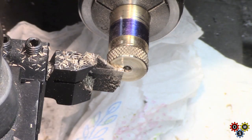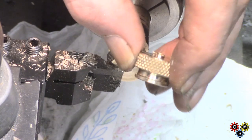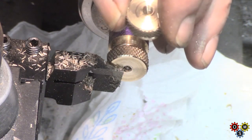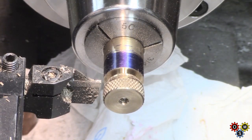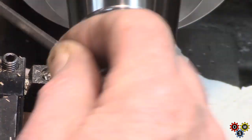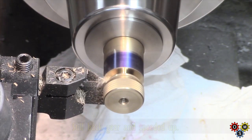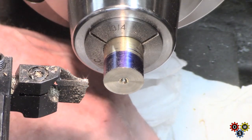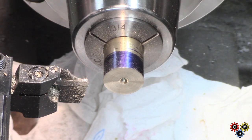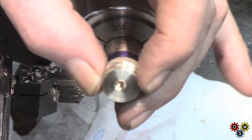I try and keep all my brass chippings separate. There's the first one — I just got to clean up that little bit there, finish boring this and threading it, and then part that off. You might hear a fan running by the way, it's bloody hot in here. I'll just put a chamfer on that before I finish parting. Just a bit of cleaning up to do on those — polishing, chamfer in there, etc.